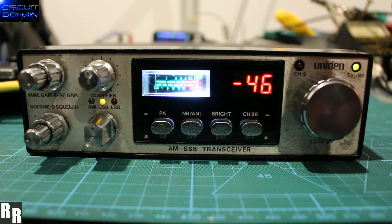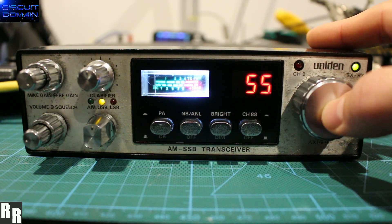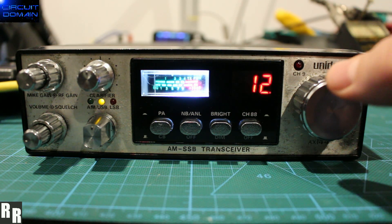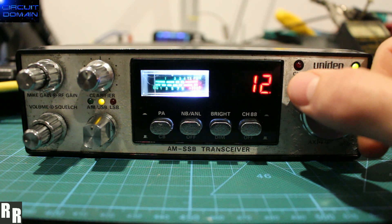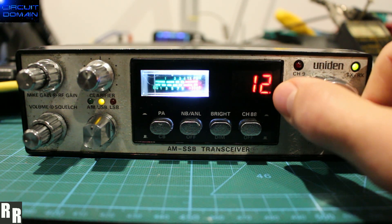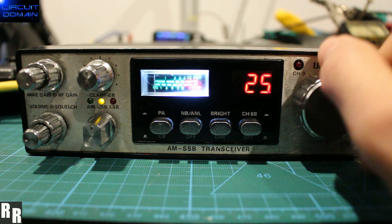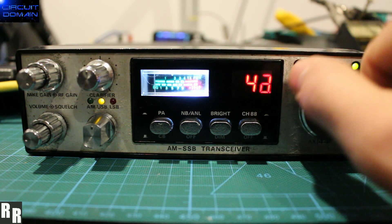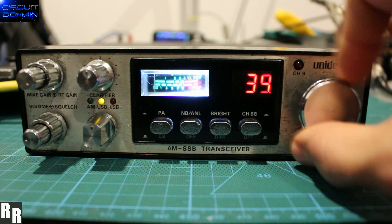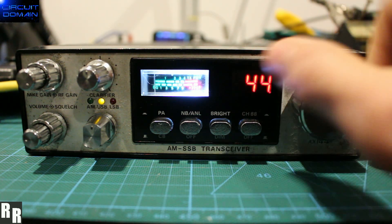Three button press will be your split RX-TX. You choose how many channels you want the TX to be separated from RX. In this case, we had 12 in there set up beforehand, but we could choose — say, nine. You could choose any arbitrary number; I'm not sure where the maximum limit is, and it's not really that important. If you just want some separation, you can choose up to whatever amount of channels you want.